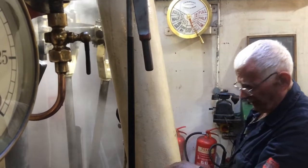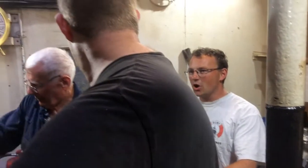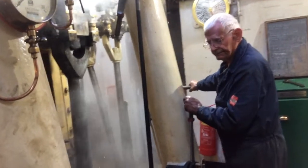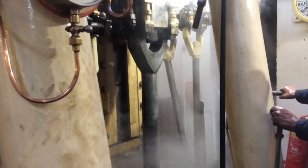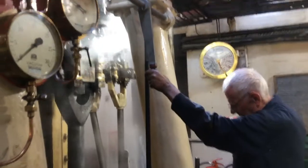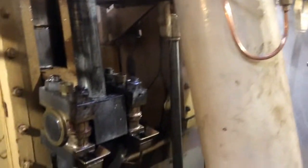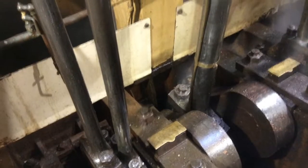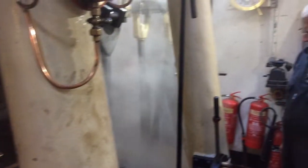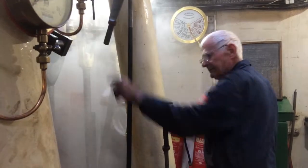It's not quite enough to turn. We're struggling to make this thing move at the moment because the high-pressure cylinder is at top dead center — that's where we needed it for the work we were doing trying to get the piston off. The lever being pulled there basically diverts steam from the high-pressure cylinder into the intermediate pressure cylinder, which is on a different part of the stroke. So the theory is it should move it — it just takes a while.